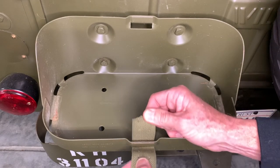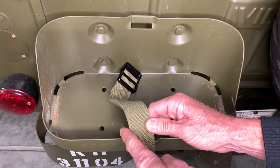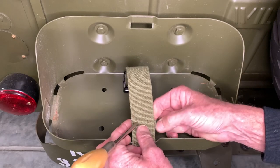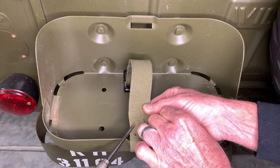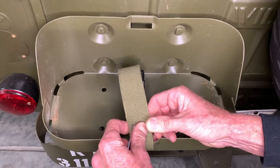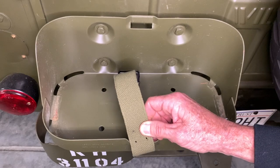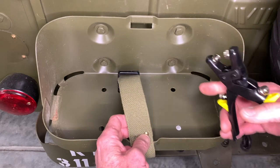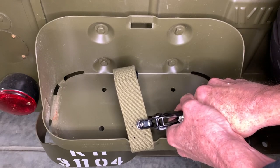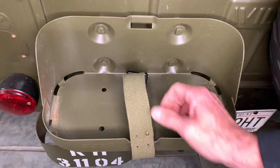Insert the strap into the bottom of the jerry can holder and fold it up to match the holes. You can use an awl to line them up on the opposite side while putting the other rivet in. Push the female side of the rivet into the hole and it'll stay. Then take the male side, sort it through the hole, line it up with the rivet on the other side, and it'll start to go with just your fingers. Then take the tool, line up the cups, and simply squeeze — that sets the rivet nicely. Repeat for all four on the bottom strap.